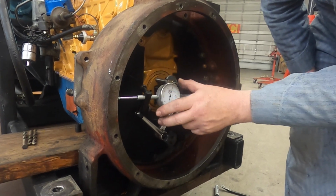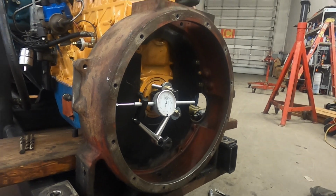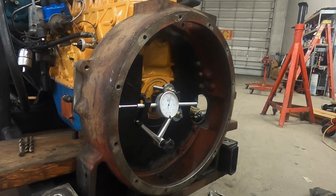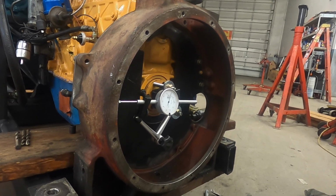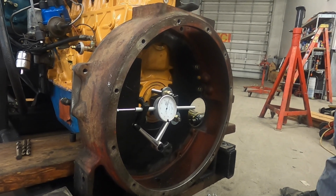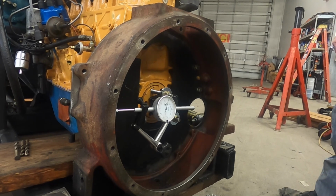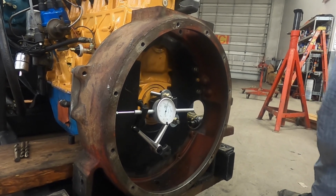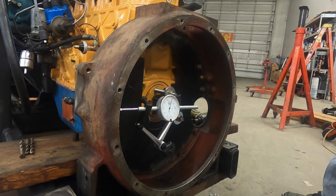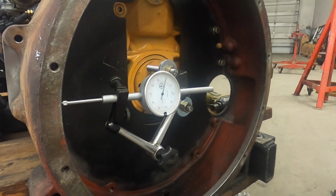We got oil in the engine? Yeah, that's a minor thing. I always like to put oil in when I do it, because the oil pump is going in the right direction, putting oil up in it. But we can do that, it's up to you. When I set this down in here, I wanted as little oil on it as possible, and that's what I did this morning. So I didn't put the oil filter on it either. Whatever. Okay, let's just ignore it. It should have enough pre-lube. I get ridiculous sometimes with little points. No, I understand where you're coming from. You ready to go? Yep.